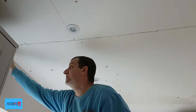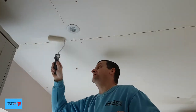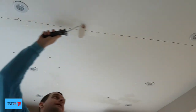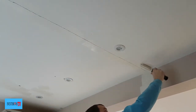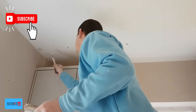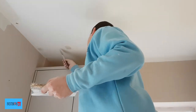Along this ceiling crack there's water damage — if you look closely enough you can see it. We need to deal with that water damage first. For this I use Zinsser BIN shellac-based primer to seal the watermarks. You can also use oil-based undercoat to seal the watermarks; the only difference is that Zinsser BIN dries a lot quicker than oil-based undercoat, but the outcome is the same.